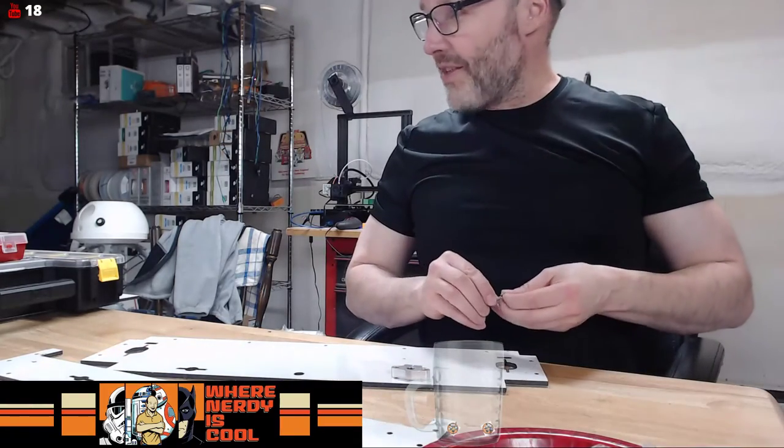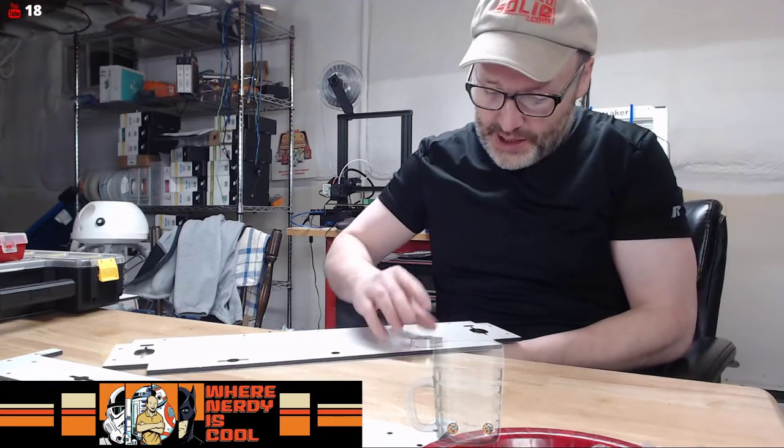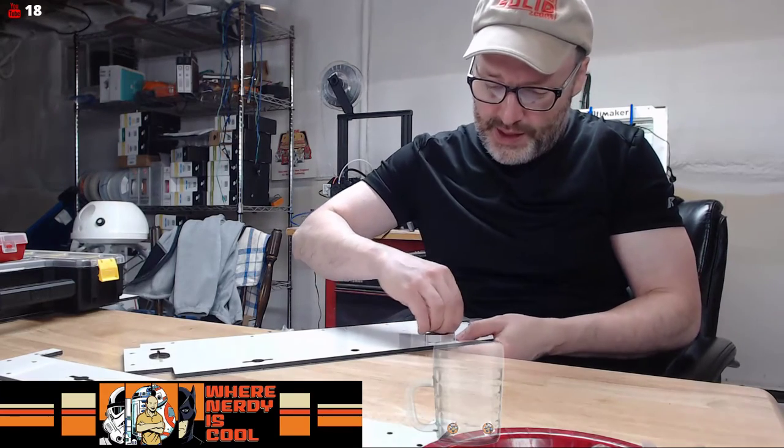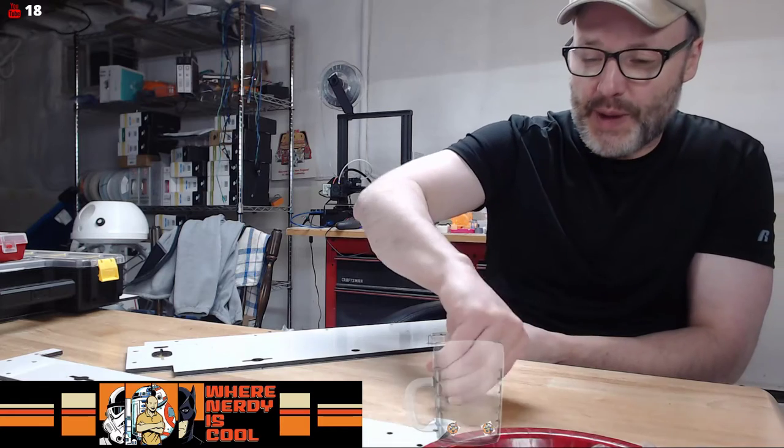As soon as we get this guy done, we're going to regroup, because we did figure out what we need to do on the i3 Mega. We need to move the limit switch to the outside of the frame. That will give us back the space we were missing.